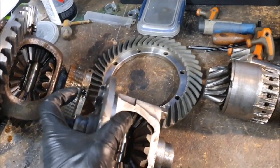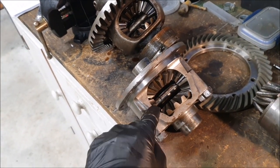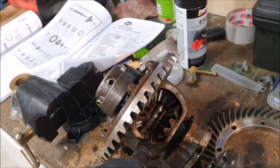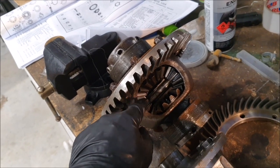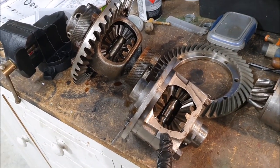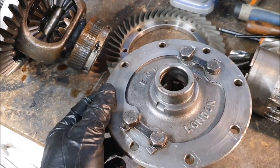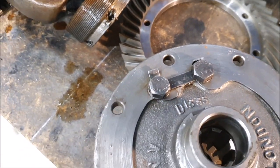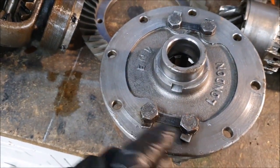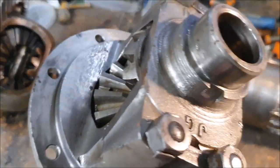This is yet another difference I can't quite figure out through the parts books — the actual differential carrier itself with the spider gear. This is the second-hand one I had to get from the UK, because the one that came with the car originally had all the gear teeth busted up, so it was easier to get a good second-hand one. It's different to the original in the parts book. The number on it looks like D1335. This is an ENV unit, still with all the original ENV bolts, which is quite nice — even the lock washers are ENV.